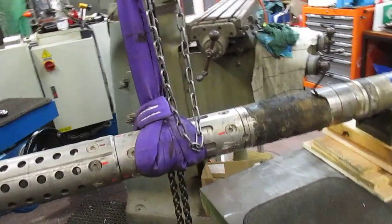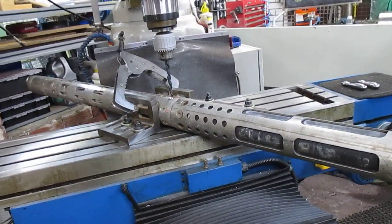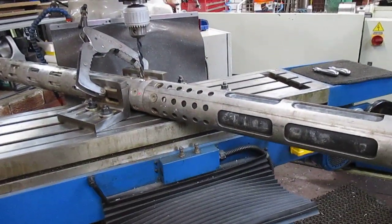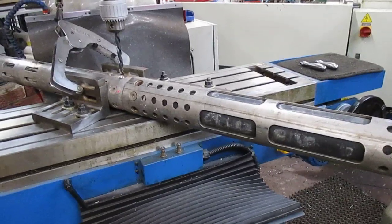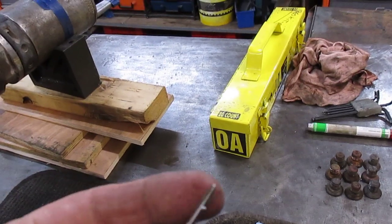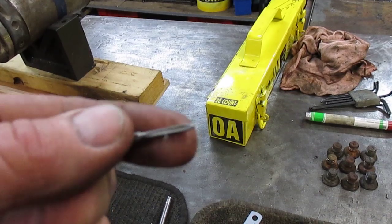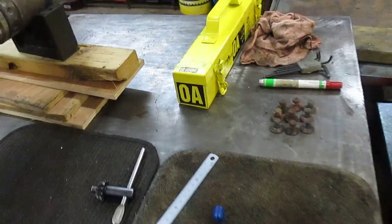I've ordered special tools to come from New South Wales, and amongst them also is a helicoil set because one of the holes is too large. The customer had already tried to drill it and three of them have broken drill bits inside. So you can imagine something of this size that has a drill bit broken inside — I have to get that out and also look after those threads. And this is all high tensile stainless.